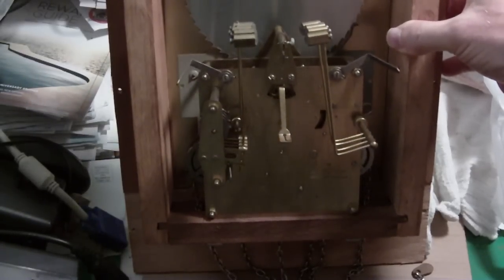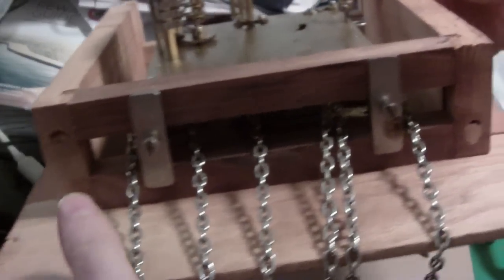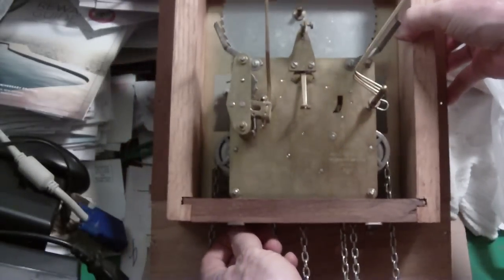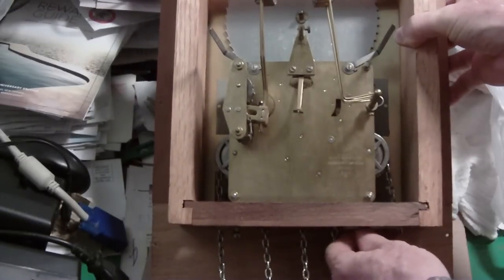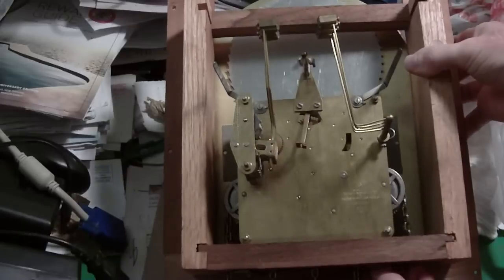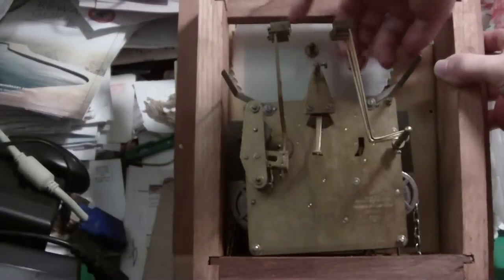take this out, swap out the movement, and I guess underneath here there's a couple of, you see those two screw things, one there and one on the other side. You have to loosen those up. I'm going to do it like this because I don't want to hold it. And the things rotate. Whoops. I guess I'm going to hold on to this. You see the metal bars rotate. So you rotate them in such a way that the movement comes out. I mean, you can unscrew it all the way. But I'm rotating, so I'm going to grab this.